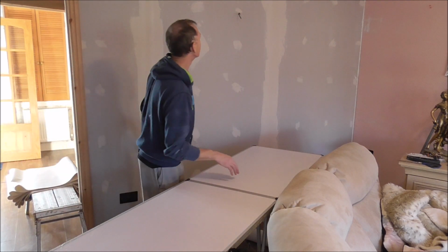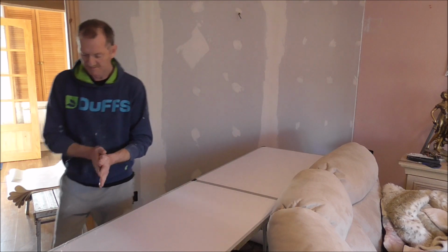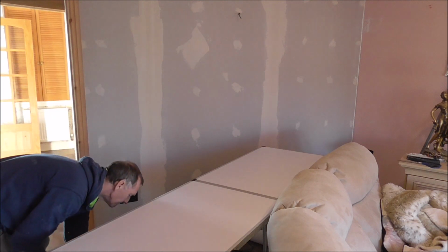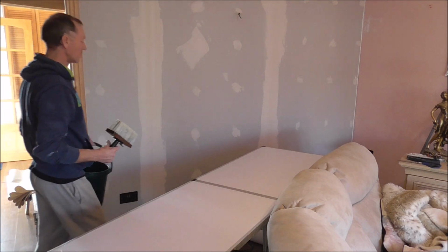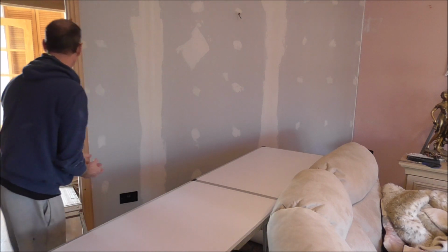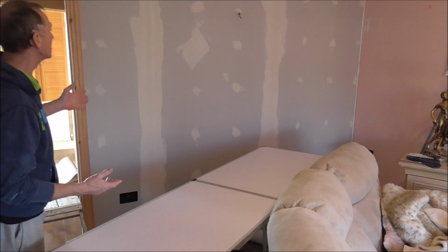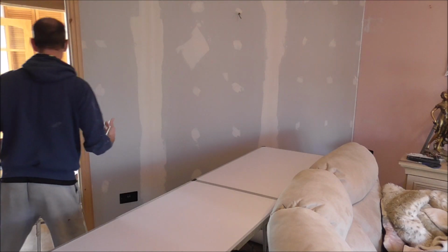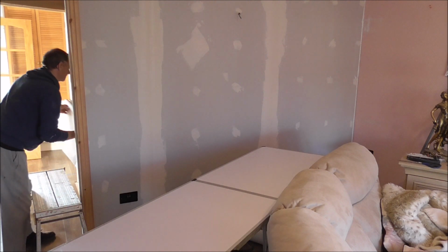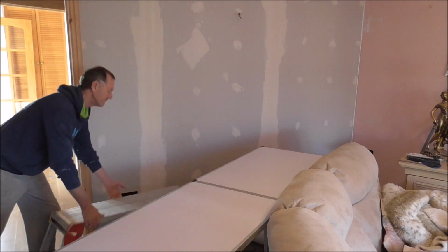And as this wall only takes six, then one quick pasting up is done. Right, like I said with the other job I did, when you're doing a new plasterboard wall, always size the wallpaper, the wallboard. That is, put wallpaper paste on the wallboard, especially on any joints. And it just helps the adhesion of it all. This is what I'll do now.